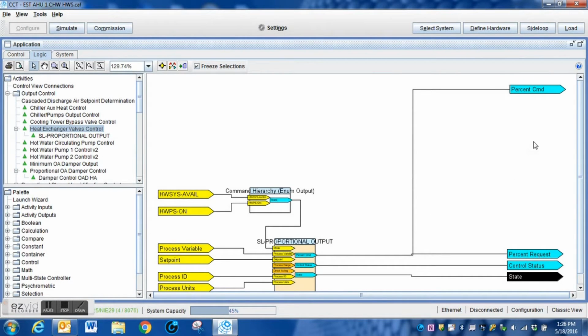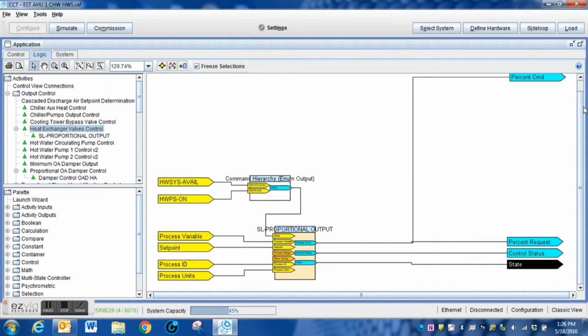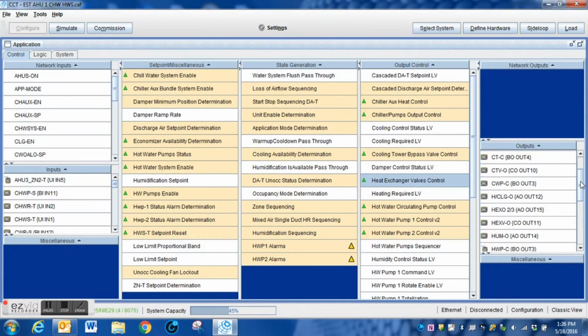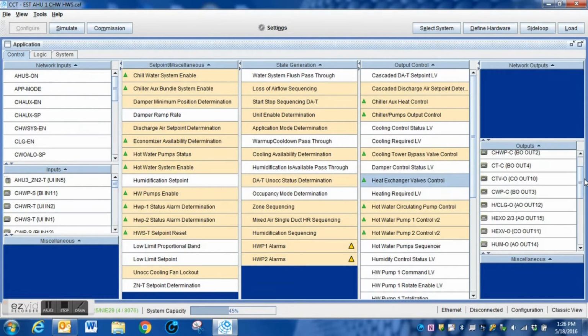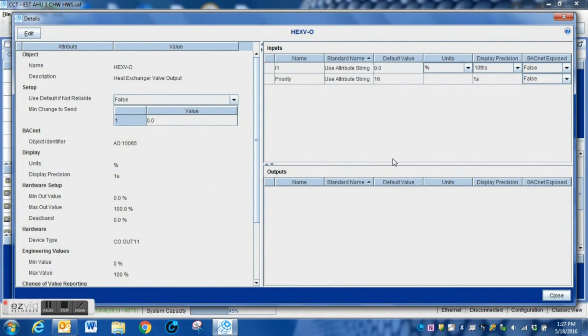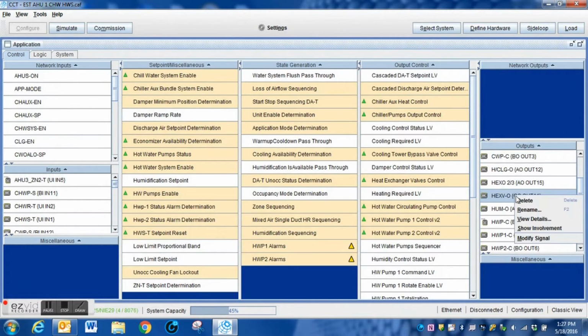and this is going to bring us into the inner workings of that logic block. This is where we have got to modify. Currently, this is tied to just a single output. Now, the way that we know which logic block that it is linked to, we're going to look at our original output. If I hit the right button, this is the original output. This is what we're basically wanting to replicate. We're going to be reusing this particular hardware output.